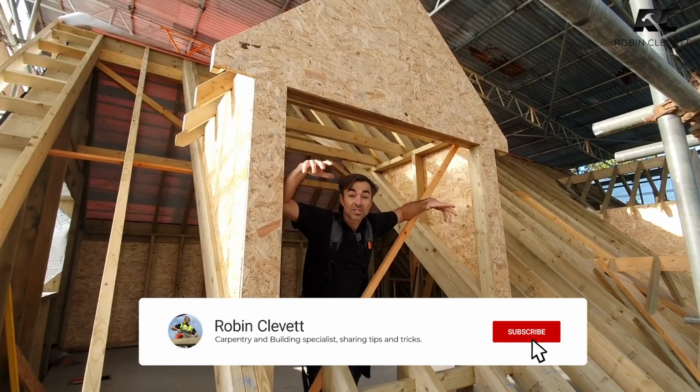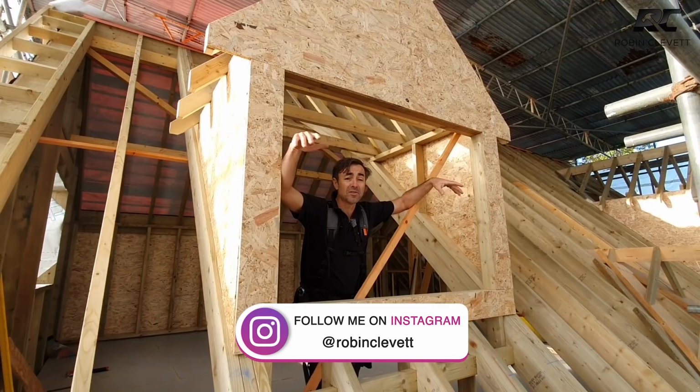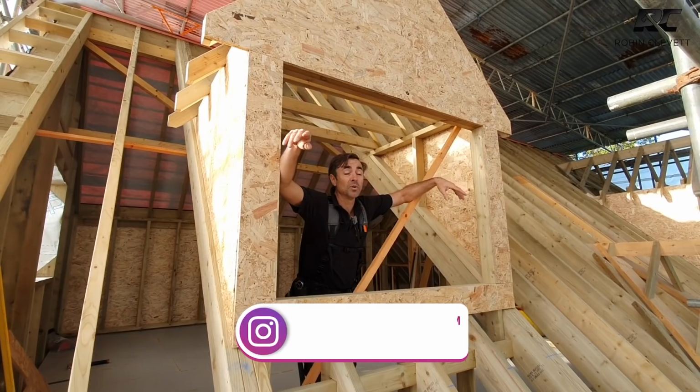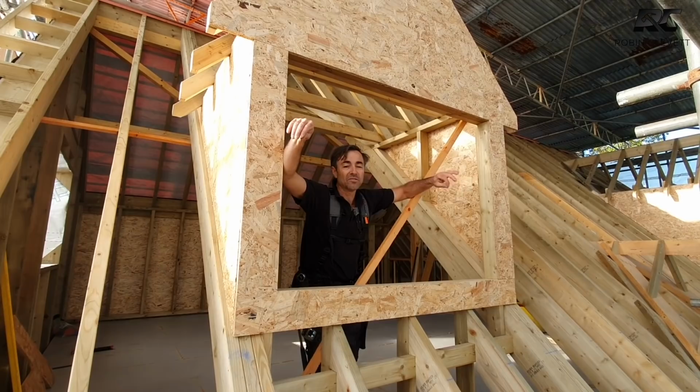Now I've basically finished the roof here and we're just covering it all in now with felt and batten. We call it felt and batten. It's a breather membrane and it's also a British standard batten. In our case, everything's red, so we've got this red batten, we've got this red felt, and basically that identifies the product to the building inspectors and that sort of stuff, in some cases. And also in our case, because we're using a manufacturer's guarantee across the board, we need to follow their system, and their system is red batten and red felt.